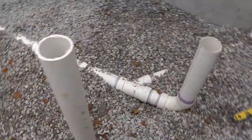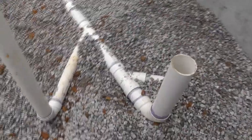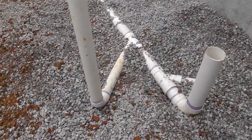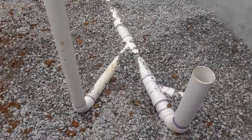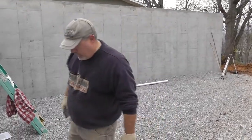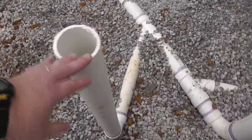One job where we didn't tape these, we got concrete down in the pipe. That was Spring City — that was your favorite customer. We had to cut the concrete out underneath the lavatory; Eric took the slab out, we had to jackhammer up the concrete and get down into the ground. So what did we learn from that? You need to get some duct tape and put it over the top of these.